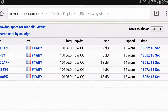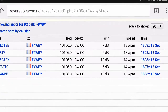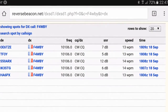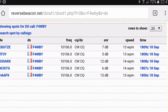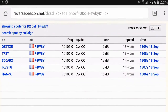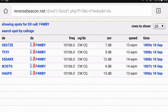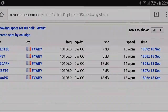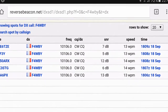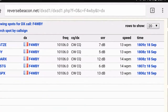I wanted to mention another advantage of military manpacks, and that's their coverage. Usually from 2 or 3 megahertz to 30 megahertz for HF models. That includes CB frequencies for emergency only, of course, but it's good to have, and you can listen to CB as well. Also, the VHF manpacks, like the PRC 351 station, which I believe goes from 30 to 70 megahertz. That includes the 6 meter and, for those who can use it, the 4 meter band.